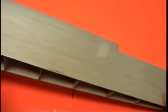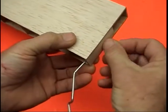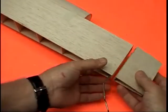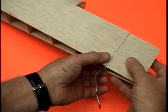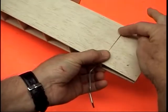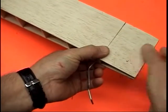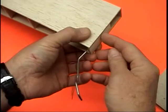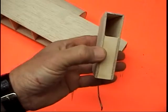effective. And so what I'm going to try to do is measure the point at which, and then drill this hole in from here, but I've got to transpose it out here first. So I know an example, and I've got to get the edges on this, of course. What happens is if that bolt is off center side to side, this tends to do this. If I put the bolt way up here, this will tend to do this. If I put it at the bottom, it'll do that. So I'm going to try to centrally locate it, but I've got to locate it around that wire. So once I locate that, then I can transpose that number out onto here.